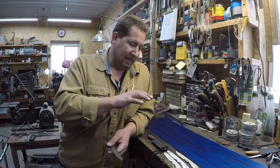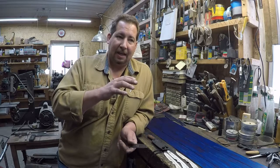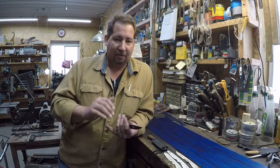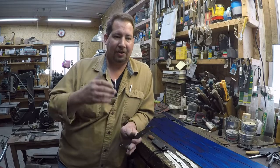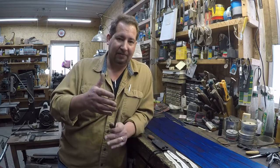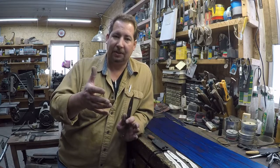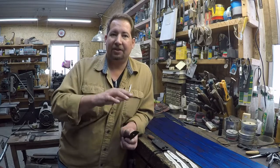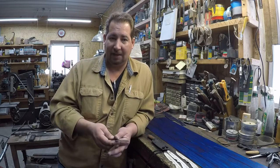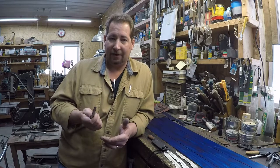So when you start getting into sheet stock, I think that the biggest difference between the forged blade and the stock removal blade isn't so much the hammering effect, but I do believe you get a little bit of benefit there. It's the heat cycles at controlled heats, heating and cooling, that makes the forged blade have the greater potential than the straight up stock removal blade, right? Which is why I cycle the crap out of this stuff before we go into heat treat.